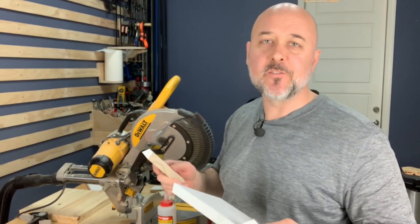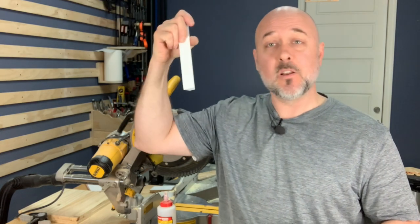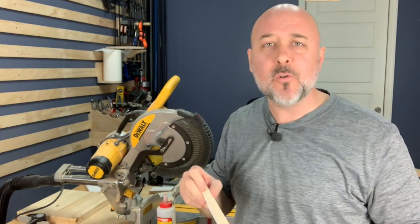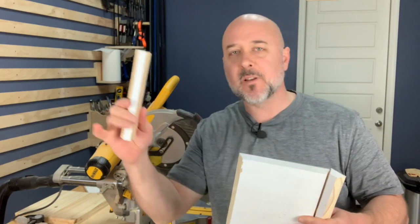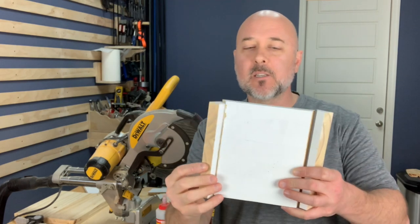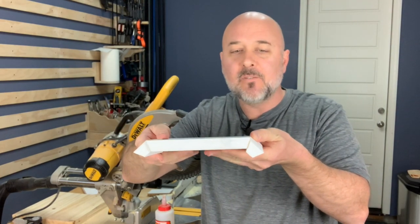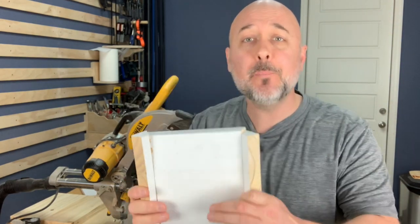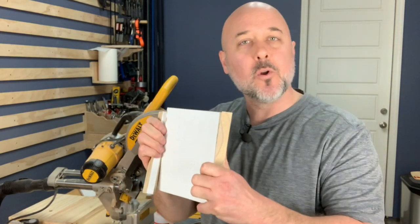One of the necessary evils in this project is baseboard that has nothing to do with the wall trim area I want to work on. The wall trim ends at the end of the wall and wraps around behind the refrigerator — the baseboard just goes behind the refrigerator and stops right there. To go around that wall, it doesn't have 45 degree miters because the wall stucco is curved. So I have these little pieces that makes it go around the wall. These aren't 45 degree angles — they are 22.5, which is half of the 45. The whole house is like this. Instead of putting each piece up against the wall, I'm going to glue this whole piece together and then put it on so it's all level and straight. Sometimes getting the baseboard to line up top to bottom and along the edge can be difficult, so I think making one whole piece and slapping it on there is a pretty good idea.